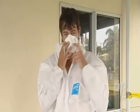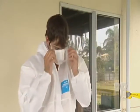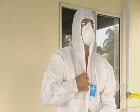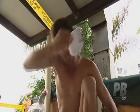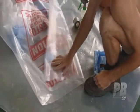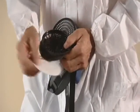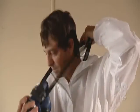It's important that a respirator's nose piece is shaped to suit the user and the seal around the face is as tight as possible to ensure no air can leak in at the sides. Once used, disposable respirators are to be discarded as asbestos waste every time a worker exits the asbestos work area. The half-face rubber respirator is non-disposable and requires a P2 filter cartridge and disposable pre-filter inserted into the front of the unit. Ensure straps are tight around the head to ensure an adequate seal.